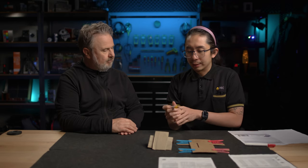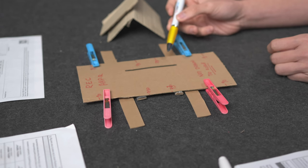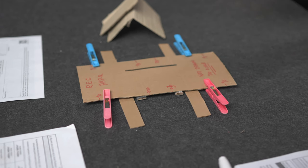Second of all is, if you look at our installation manual, the clamping zones table, there's a lot that goes in there. And I know it's a lot to take in because there's a lot of numbers. So first of all, what you want to do is get your wind loading of the particular area that you're going to install. And then from there, you refer to the table and where you want the installation to go, what the distance is. And then see if it correlates to the wind loading at your area, and then that's fine.